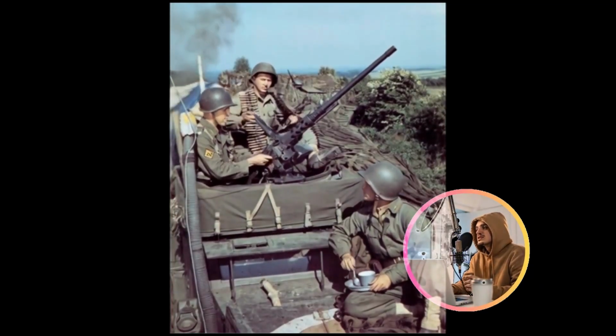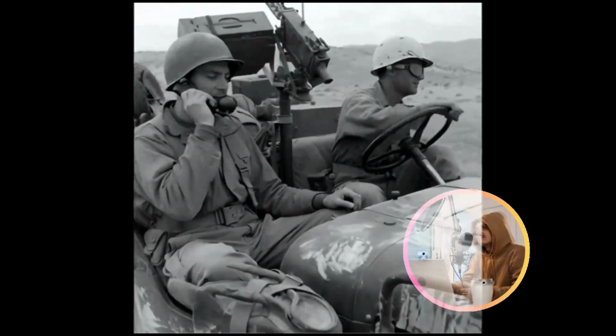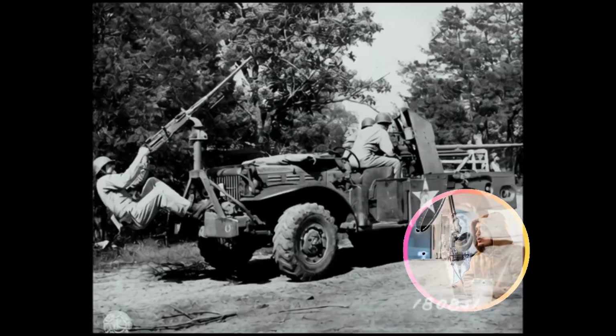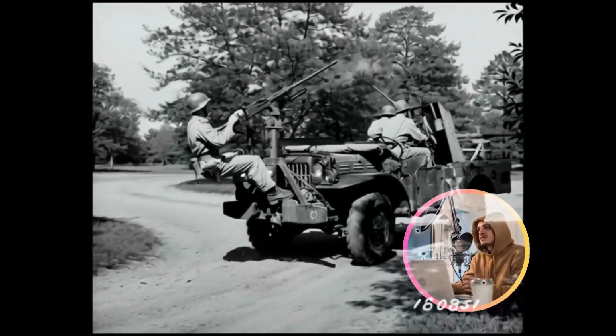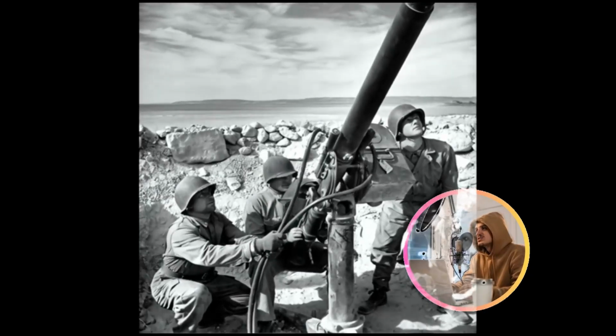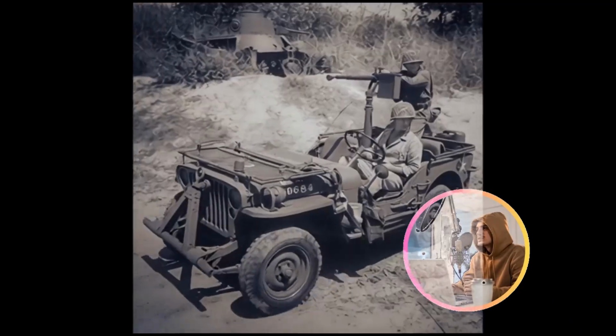The Browning M2's bolt assembly, weighing 17 pounds, traverses approximately 6 inches backward with every shot, cycling at an approximate rate of 450 rounds per minute in sustained fire mode. This translates to 7.5 cycles per second, or a frequency of 7.5 Hz.